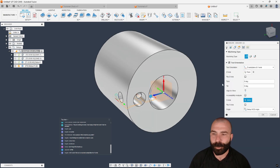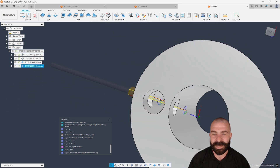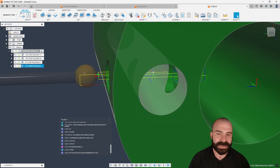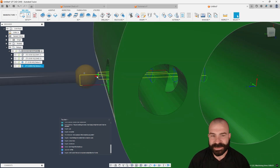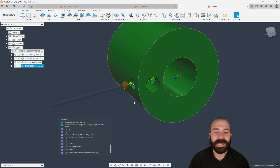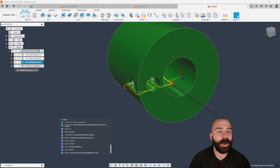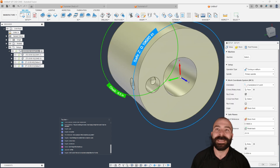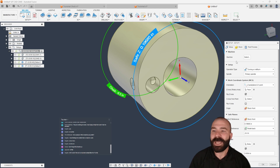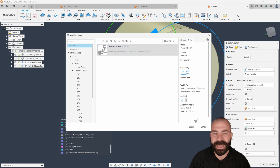So let's do every scenario we can think of. Tool orientation — Z is now pointed outwards, same exact edges are selected. As you're going to see, we can come in from the outside and do the same thing. This blue line will confuse people — this is actually the lowest center point of the ball, so we're very deep with the blue line coming in radially; that's because the back of the ball is actually hitting those surfaces. Keep in mind here I am leaving this in three axis mode; we may actually have to go in and swap it out to four axis mode. This is the importance of getting a support plan with somebody like JIT CAD CAM — we're going to need to define a machine that has the ability to do that exact feature.